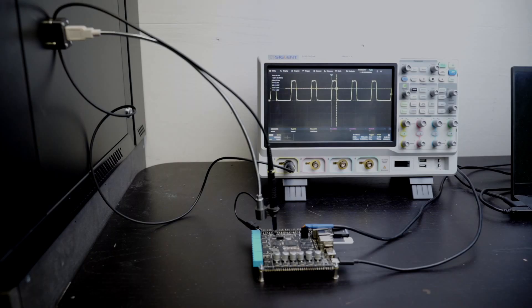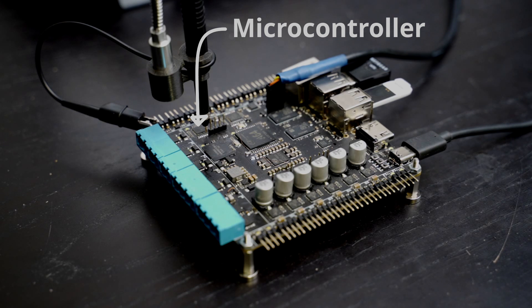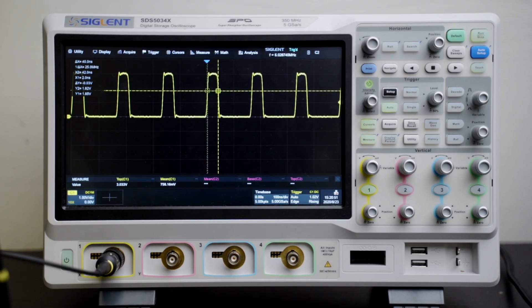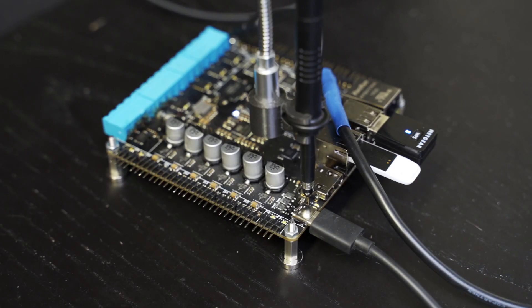This is novel because it shows how to do real-time motor control with Linux on a single SoC. This video explains the trade-offs and how it can be done. Let's start by looking at the extremes: if you set up a microcontroller to loop infinitely while toggling a pin as fast as possible, you might see a long train of perfectly square waves with a 33.333% duty cycle, accounting for the three instructions needed to set, clear, and loop.